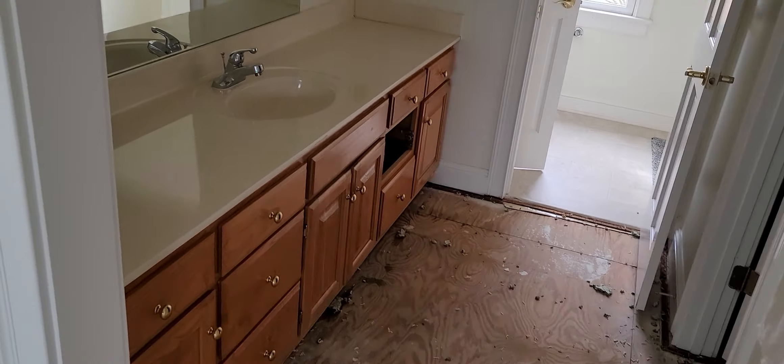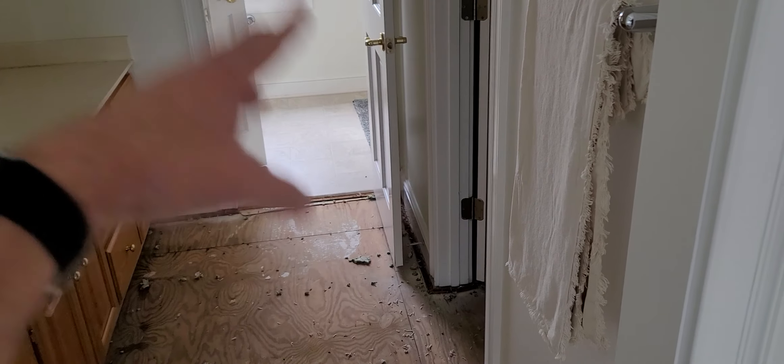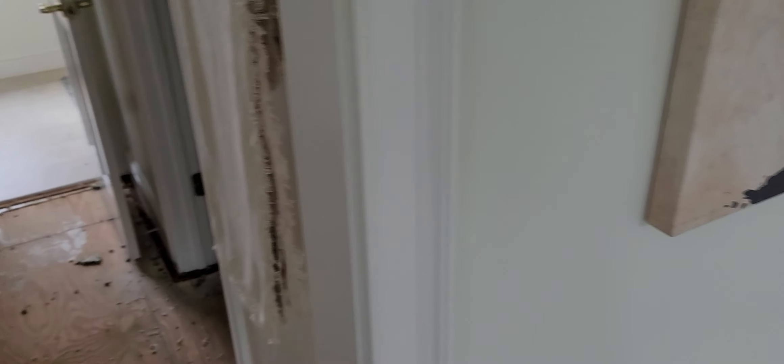This cabinet still has to be taken out. We know there's a rupture behind this wall. This plywood looks dry, but it's not — it is maxing out on my meter. So I'm going to take this floor up, that floor up, toilet out, everything. Get us down to the subfloor.